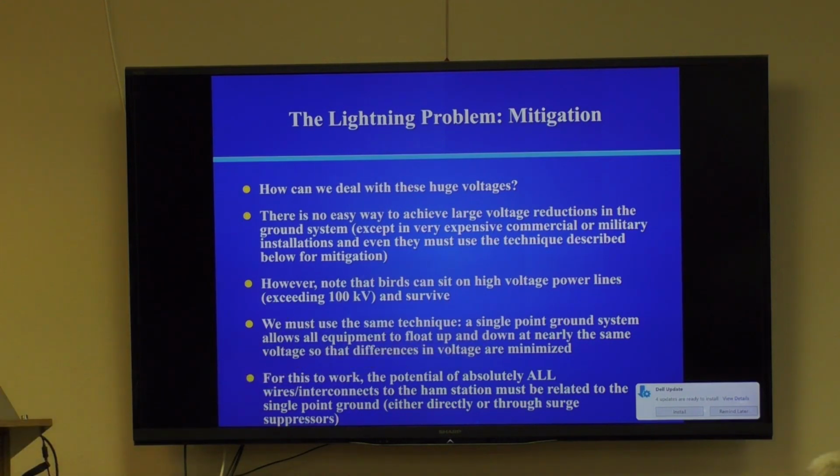We allow that ground. There's nothing we can do about keeping that ground from rising up to 10 or 20 kilovolts during a lightning strike. Not a thing we can do. You can spend hundreds of thousands of dollars and it's still going to happen. Okay, except maybe in a really expensive military system, and they spend millions to billions on that to protect a radar installation. So